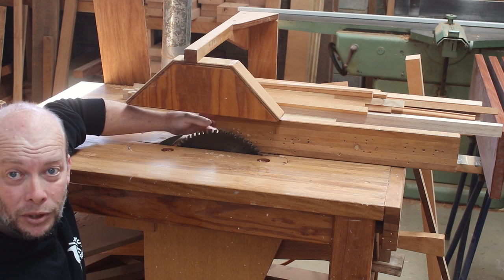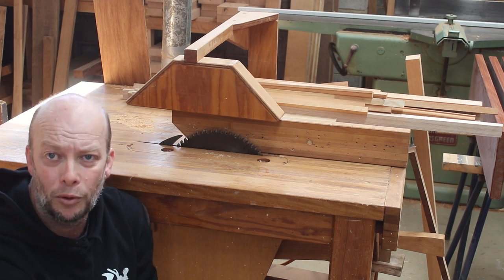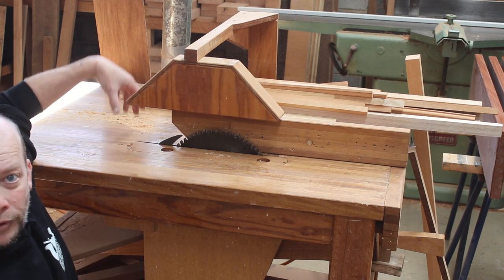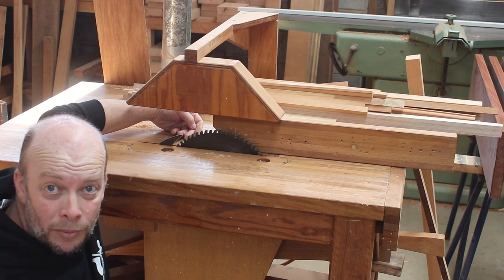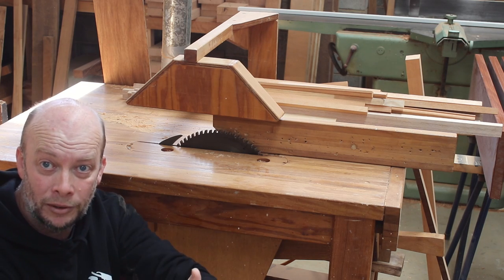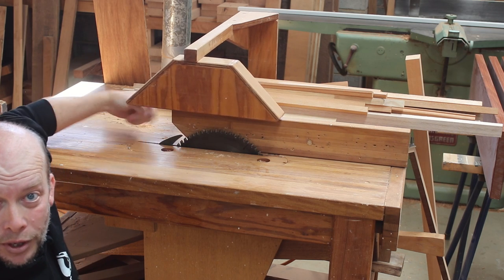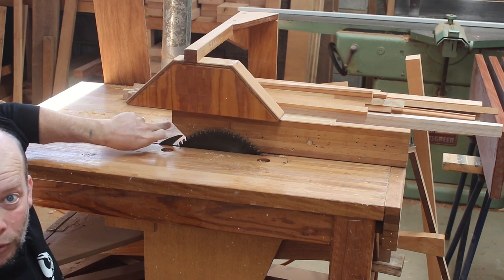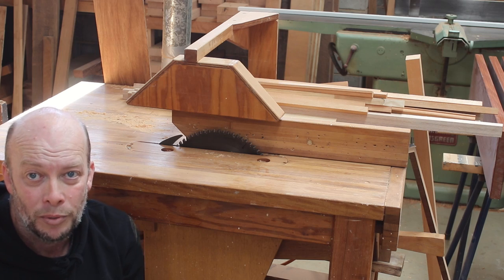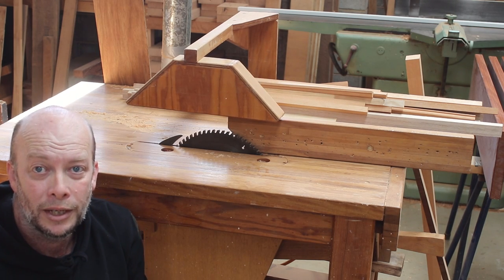If you're doing board work, it's a different thing altogether — you want your fence all the way through. On a sliding table saw generally the fences run all the way through anyway. But on a saw like this where you're just trying to rip timber, you want to have it back. If you're in a position where you have to deep cut some timber — in other words, splitting a tall block in half, coming one way through then flipping it and coming the other way because your blade can't go high enough — that's a different matter. You want your fence all the way through then, because you're passing the cut all the way through and you want as much support as possible. That's the only circumstance where I would push the fence all the way through on timber work. Anything else, it goes back — about a third of the way through, something like that.